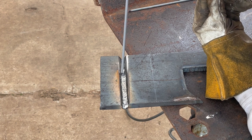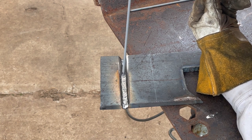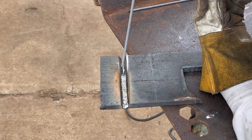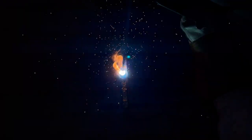So you had to — I don't know if you could see it on film, but whenever it started to favor one side real bad, I just kind of shoved it back into my puddle to burn that flux off evenly, if that makes sense. Let's finish welding this. See, it did it real bad just then, so I started pushing it into the sides to help control that toenailing. I just more or less shove it into the puddle.